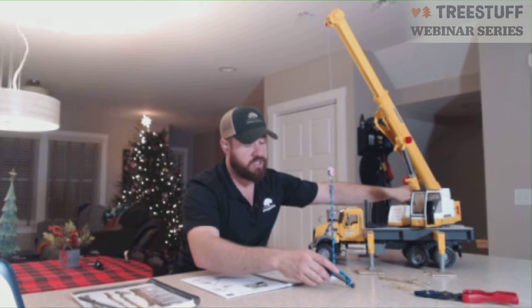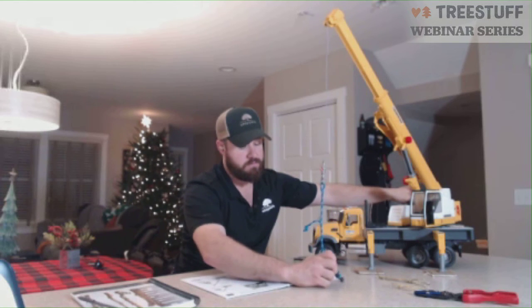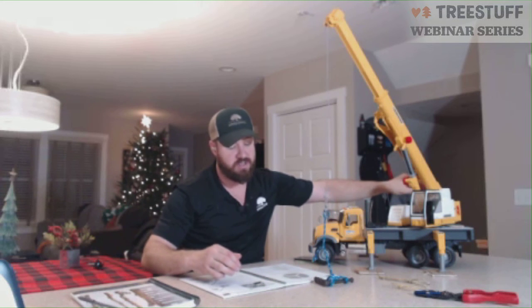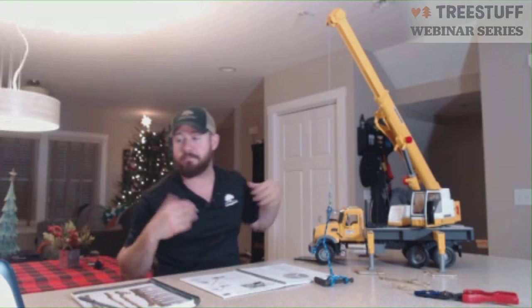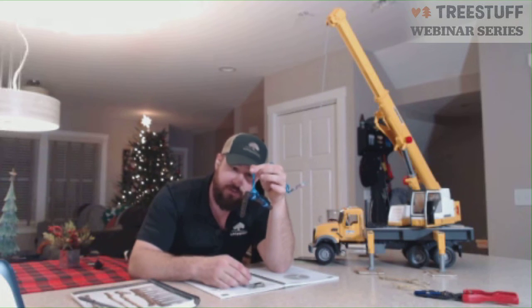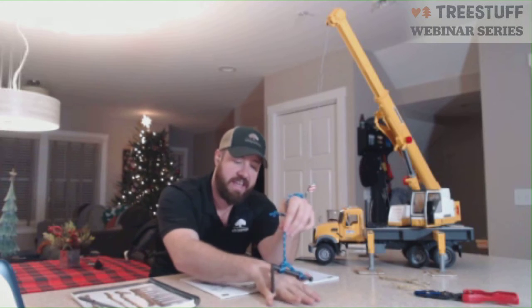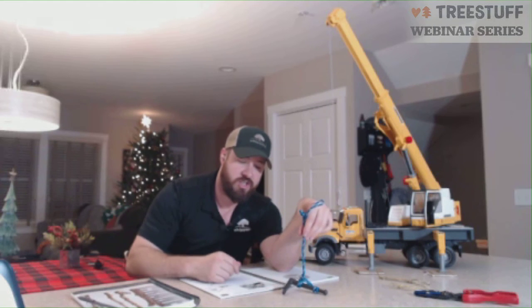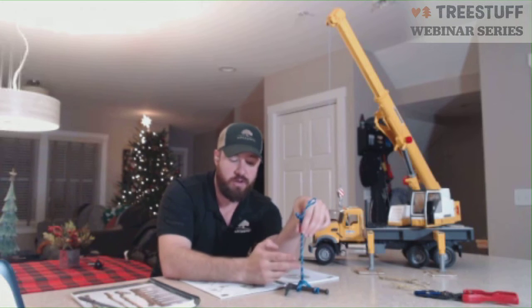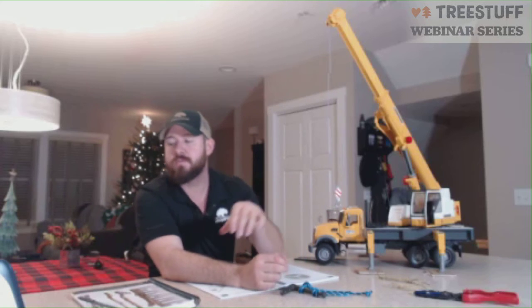If we come back in from the other direction and start setting the piece down, it's going to sit itself down a little bit nicer, a little bit easier. The piece isn't going to try to find that plumb position. So just know that when you're paying attention to your slings coming down, if it's on the uphill side, it's going to be okay. But if it comes down the other direction and lands more in this position, you have more potential here with the sling being bent back this way. You can catch branches, other material, and this piece could move around and become unstable.